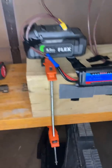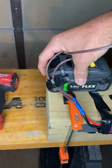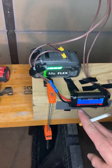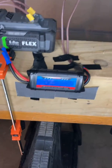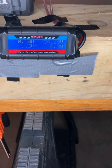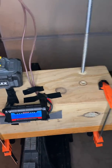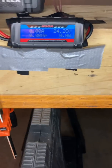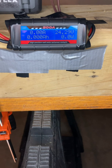Here's the Flex 5.0. I'm not going to make one cut or edit in this video so I don't get accused of anything. That's a fully charged 5 amp hour battery. I've got the battery hooked into the source side and the tool with the quick eject hooked into the load side. It's reading pretty spot on — 24.27 volts. This is a 24-volt max tool, so that's nominal voltage, which will drop way down under load. The test bolt is an 8-inch 3/8 lag. Let's get to it.